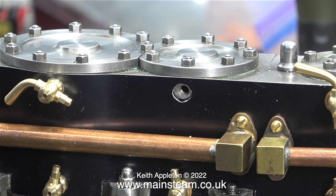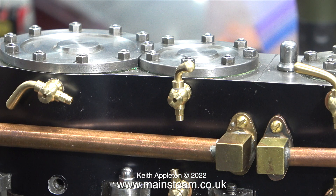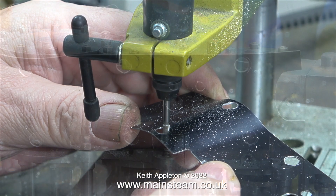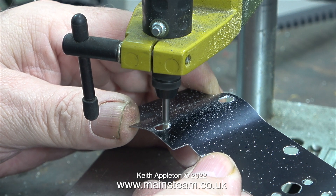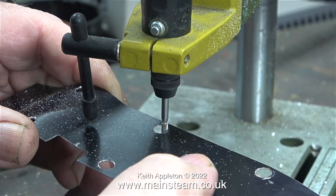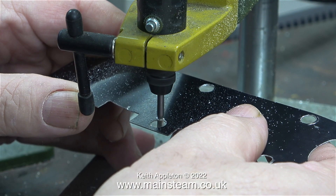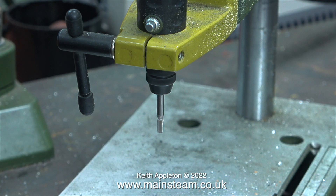The next part of this job needs a great deal of accuracy. I'm going to put the holes in precisely the right place, fit an O-ring on the threaded part of the drain cock, and when it's tightened the O-ring will get squashed out a little bit and fill the gap. By now I've got the bend around the low pressure cylinder right and I'm making some minute adjustments — just changing the positions very slightly of the holes so they match perfectly with the holes on the casting, so the flange on the drain cocks will fit through and mount up against the cylinder.